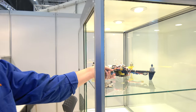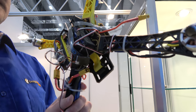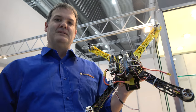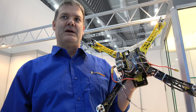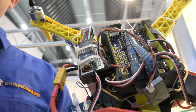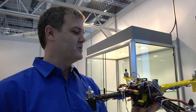Here we're showing examples of drones — this is a quadcopter, and we already have support in ArduPilot, which is an open-source autopilot code. You can run ArduPilot on this today just compiling from mainline source — they already have support for a Blue target. You can do things like set GPS waypoints, add an ultrasonic sensor for takeoff and landing support, and add GPS for waypoints.